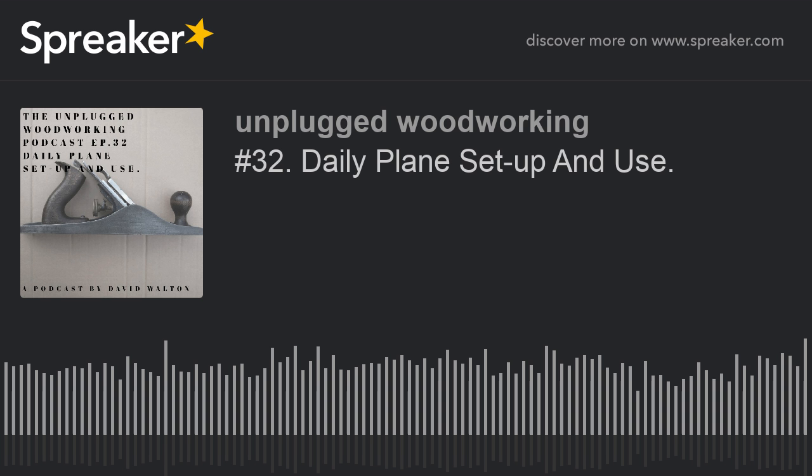So if you have got a lot of wood like this, this takes us back to where it can actually mess with your lateral adjustment. So if you're having to do this a lot, if you have got some gnarly grain, I would advise you to check your lateral adjustment often, and save you making some big steps in the wood. So yeah, that's kind of what I would do. Face planing, I don't think I'll ever change that. I think it's more force of habit now. You know, I don't think I could change even if I wanted to.